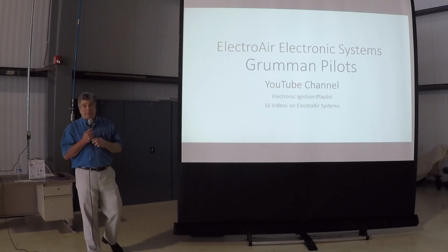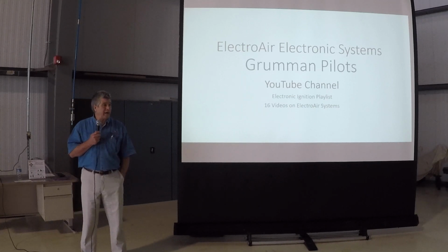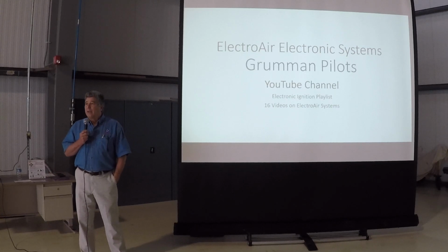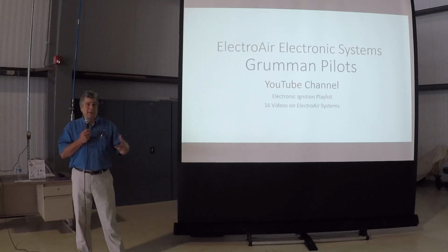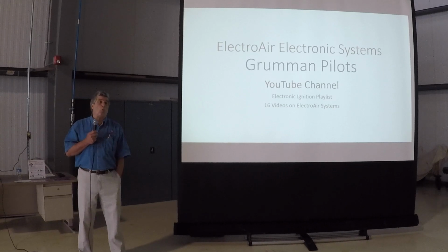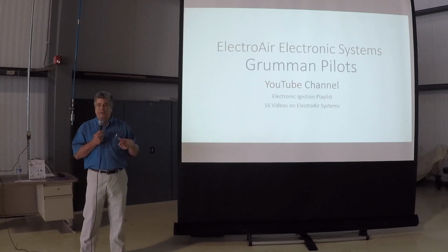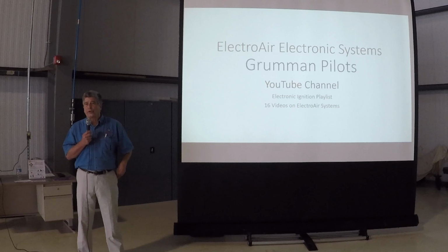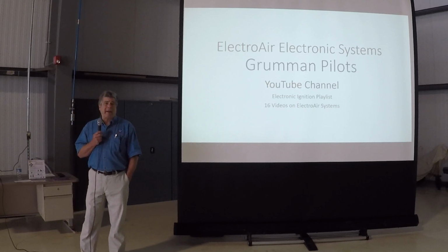The other big advantage that people like is the fuel savings. So here's what you can expect, and these are numbers that we've been gathering over the last 5 years. If you're running a six-cylinder, whether it's a Continental or a Lycoming, in the 540s, you can expect to save about 2 gallons an hour. You'll be able to lean much more aggressively. As a matter of fact, you'll be able to lean more aggressively than you should for your engine. A gentleman just installed one on a Tiger. If you've got an O-360 engine, whether Lycoming or Continental, you're saving about a gallon and a quarter an hour, about 1.25 gallons. In the O-320s, it's right at about a gallon.